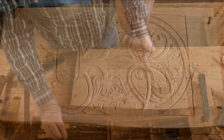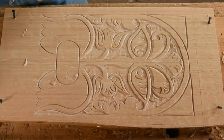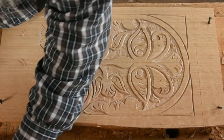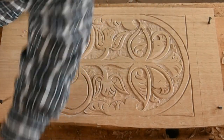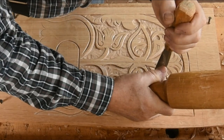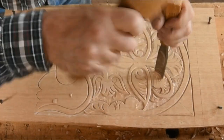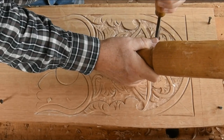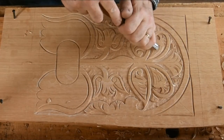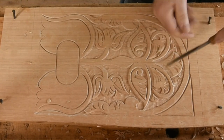Now you're thinking — well those are blank, so let's put something there. What I drew is something a little bit different — something I've seen in lots of applications. A narrow gouge there is sort of a stop, and then this wider number seven like that, to sort of connect the dots. And then an echo outside it, and the bit in the middle comes out.